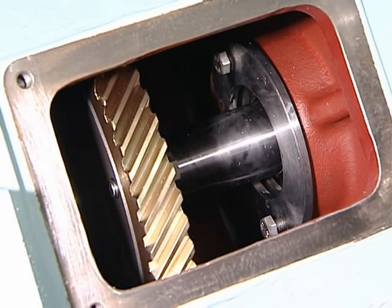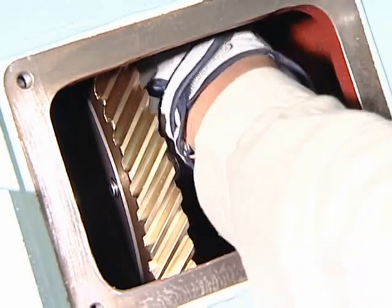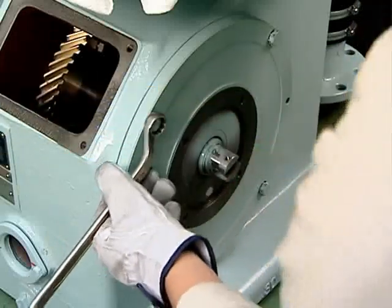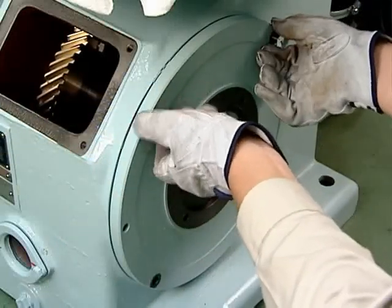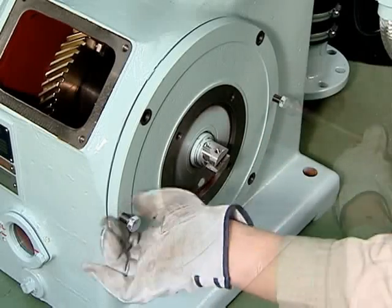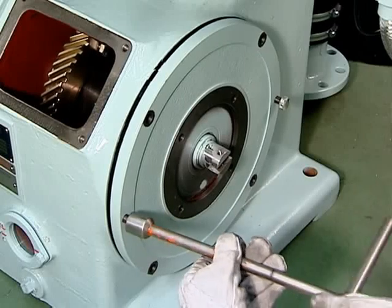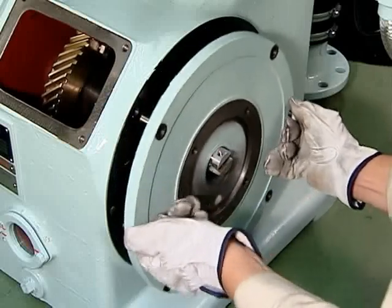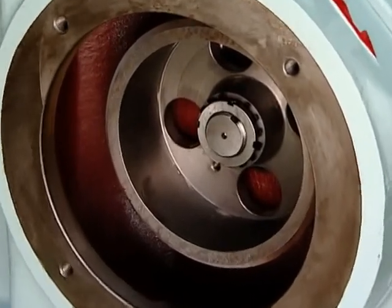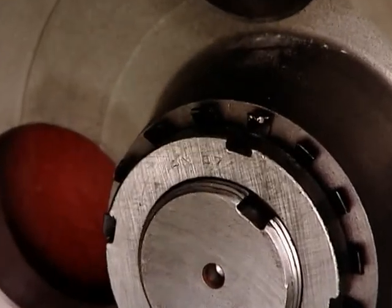Remove the 2 bolts fastening the bearing retainer. Remove the 4 bolts fastening the large bearing housing. Screw the push bolts into the 2 push bolt grooves on the large bearing housing. Remove the large bearing housing. Remove the friction pulley mounted on the motor. Set the lock washers to prevent turning, then loosen the bearing nuts and remove the bearing nuts and lock washers.